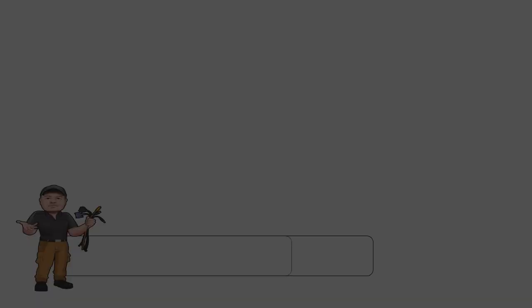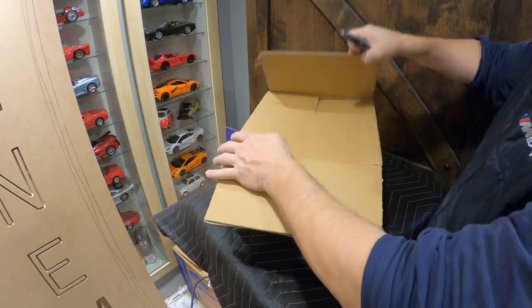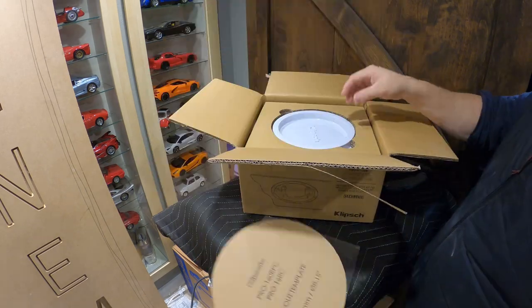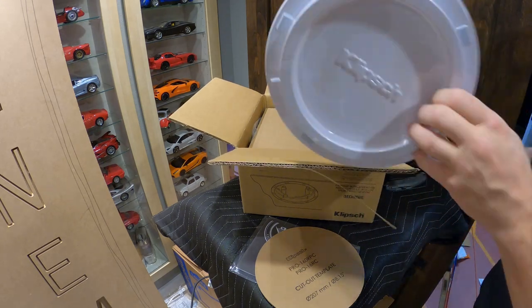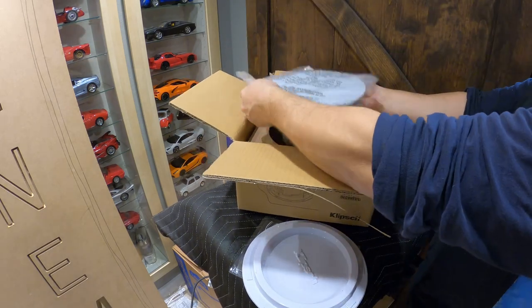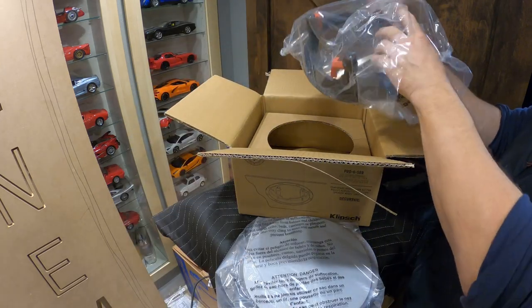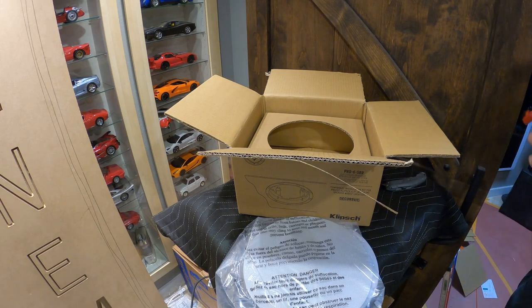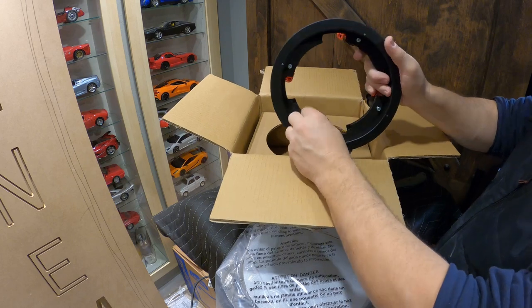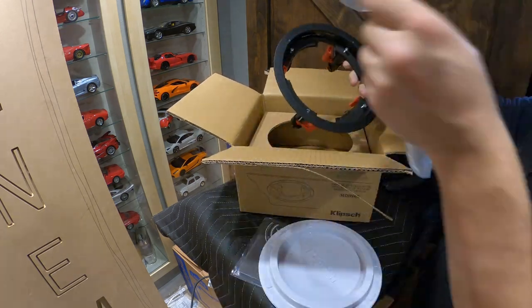So the manual you can pretty much toss out. It does have a cutout template, which is pretty cool. Then it's got the same magnetic grill for paint — this is the paint shield, it pops up on there for painting, which is nice. You've got your grill and your frame. This is truly just their speaker rough-in bracket. It mounts up in the ceiling with the same quick-lock wings that pop down. It's got foam in there and all your holes, so you're perfectly ready to go for the install of the speaker, and then you'd drop the speaker in with a nice void there.